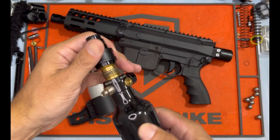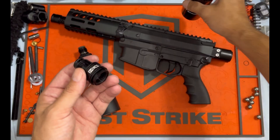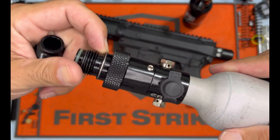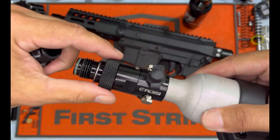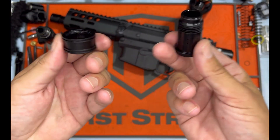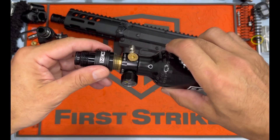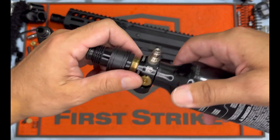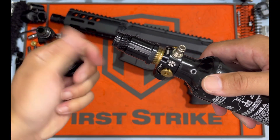I'm sure glad this exists now because I don't have to throw out all my non-slide-check regulators like this one. How this one differs: this regulator does not have it, but the slide check has a retaining ring — this little snap ring right here — which prevents you from pulling the collar off. In this case, I can pull it right off, which makes servicing very easy. Should it get stuck on your bottle, this does have two flats here, so you can move it up and get a wrench on it right here to unthread it or take it right off.